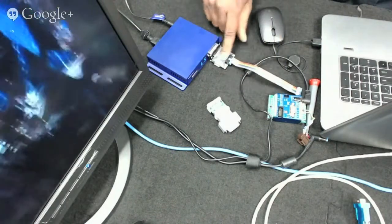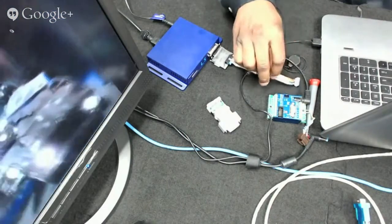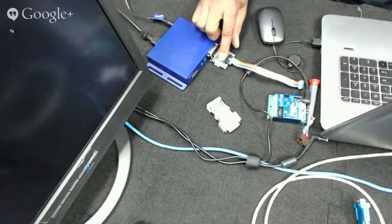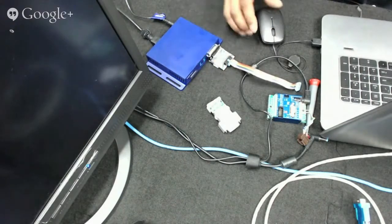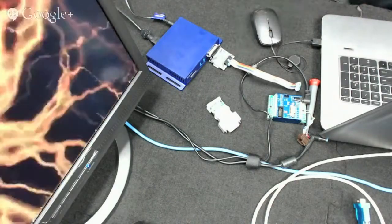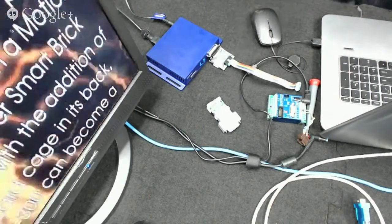That is the VHD to 1/4 J6 — connected using a ribbon cable receiving its signal from a digital output controller that we manufacture here at Gilder Fluke & Company. You can use this with a Mini Brick 4, Mini Brick 8, Multi Brick 32, Z Brick, or an SD50-8 or SD50-40. If you're not using any of our digital output devices, you can still utilize the VHD to 1/4 J6 — you simply need to provide the correct type of signal, which is a sinking powered switch closure.